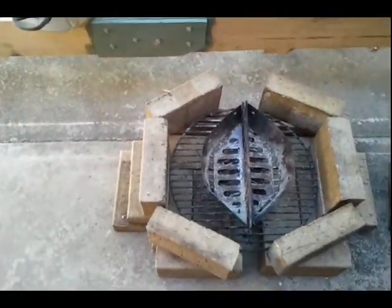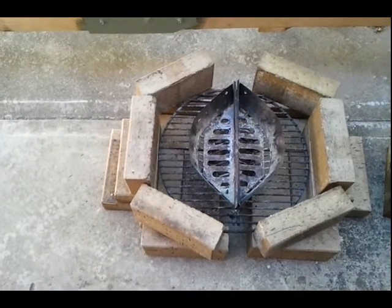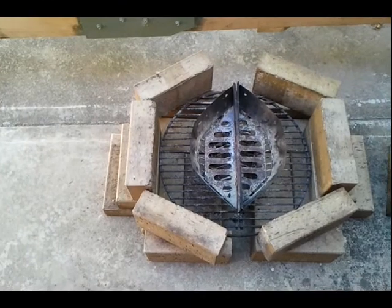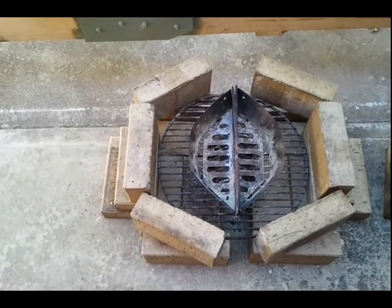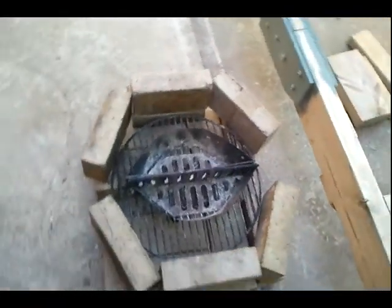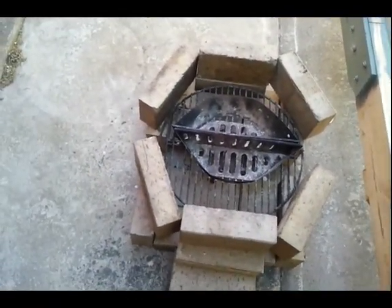It's bits and pieces out of a barbecue. The bricks are not refractory bricks, and hence they will in all likelihood crack — maybe even go bang — as they heat up. There's a bit of moisture in them, but so long as that's expected and we can deal with it, and we've got safety precautions around it, that'll be fine.